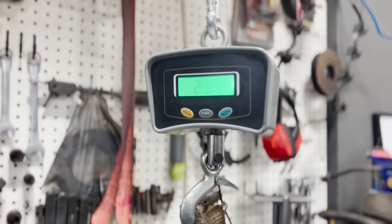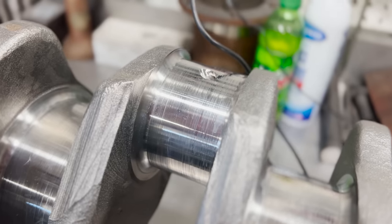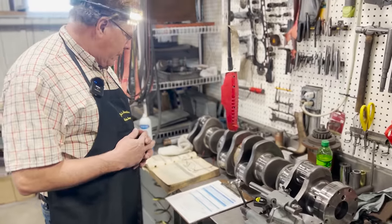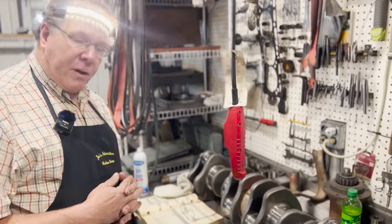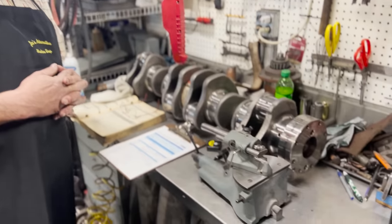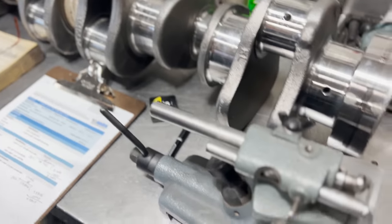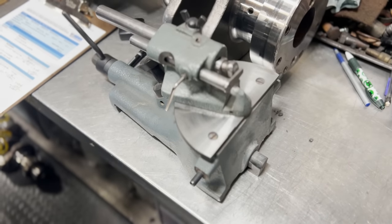In today's video, we're taking you through the entire process of grinding this 240-pound L10 Cummins crankshaft, and you're going to want to stick around because the cleaning guy messed something up on this one. Going through, figuring out my specs, figuring out what bearings I can get, figuring out if the bearings come in metric undersizes or inch undersizes, because that does make a slight difference. Getting the diamond set up here, because I need to dress the proper radius on the wheel that we're going to grind with.